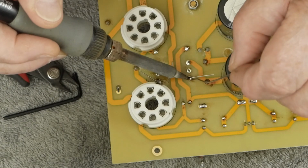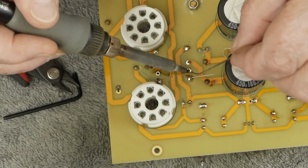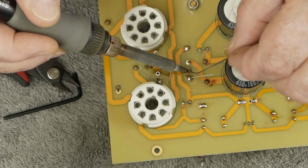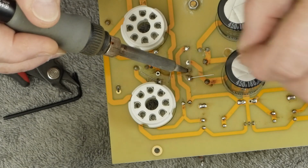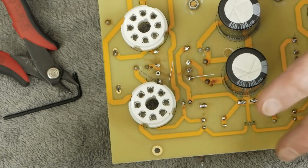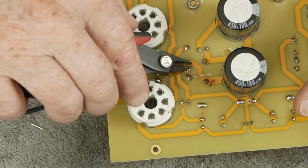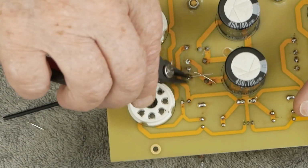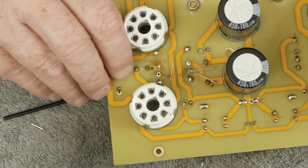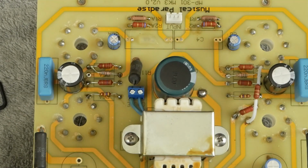And some say there's a little rule about good sounding single-ended amps. You want to use a triode to drive a pentode and a pentode to drive a triode. I don't know if there's a whole lot of truth to that, but I have found that all the amps I've built so far that really sound good follow that rule.